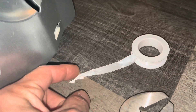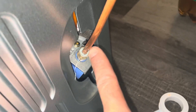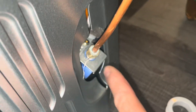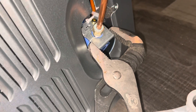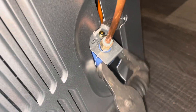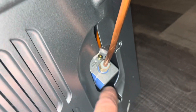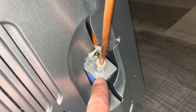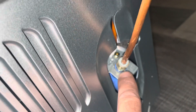Also use thread tape. Wrap around about four times clockwise onto the thread of this joint here. Have one pliers on this nut and one pliers on this, just like that, and lock on really hard so you can control the movement. Counterclockwise to unscrew the little nut, but clockwise goes on. If you use thread tape, make sure to go tight — that ensures about 50% more that this is not going to leak.